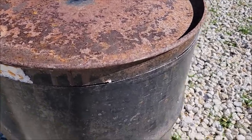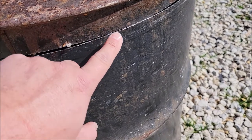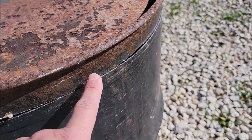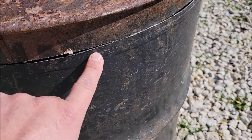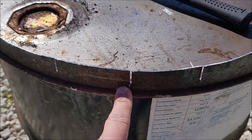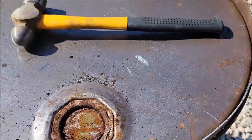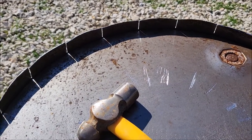Setting the lid back on top, since the barrel is the same diameter top and bottom, there's no natural lip or overhang — the circumference is the same. So I'm going to cut notches in the lid using the sawzall, then slightly tap those sections outward so they're beveled just enough to sit right on top of the barrel cut. The sawzall made very quick work of cutting those little notches all the way around the lid.